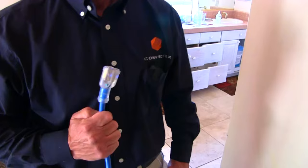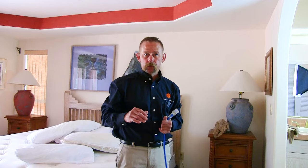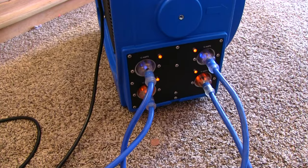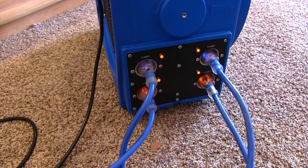All of the cords are lit and have indicator lights when there's power running to them. If by chance I plug two of these into the same breaker, I won't know right away which two they are because two of those lights will be dark. Then I can take one of those cords and move it to try to get it to a different breaker — that's a real easy way to tell if you pop a breaker which two cords are on the same circuit.